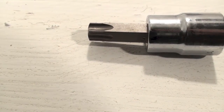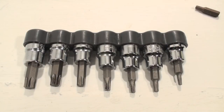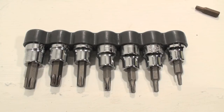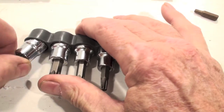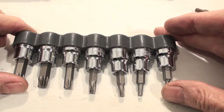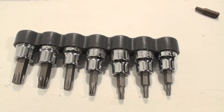This one here is an example of a Torx on a 3/8-inch drive socket set, which is a neat thing to have. There are a number of different sizes. Here's a whole kit of them from the little one — down to about a T15 — up to the larger size, maybe a T50. These are really pretty good drivers. I'm pretty amazed at how well they drive without camming out. Sometimes I've driven three-and-a-half to four-inch screws with them even in the smaller sizes.